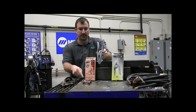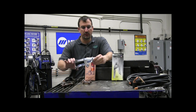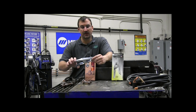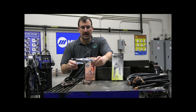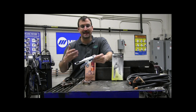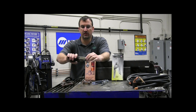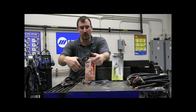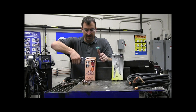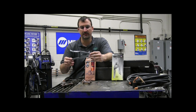This one is going to be less expensive than this casted copper work clamp. Even though it's rated at 300 amps, my experience has shown that when used at 300 amps for a long period of time, these degrade over time and become very loose, making poor electrical contact. When they become loose they heat up, and when they heat up they end up looking rusted and tarnished, losing the spring tension they had when they were new. As a brand new clamp it makes a firm connection, but over time it doesn't perform nearly as well.